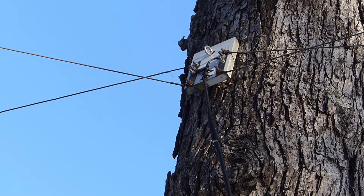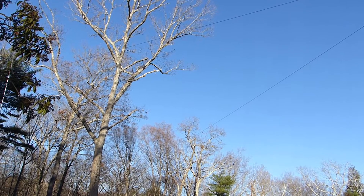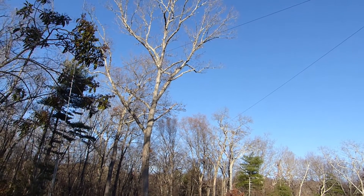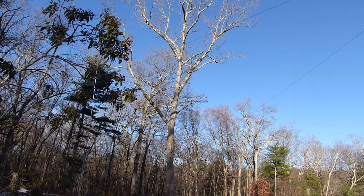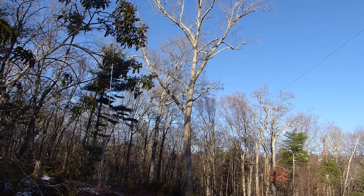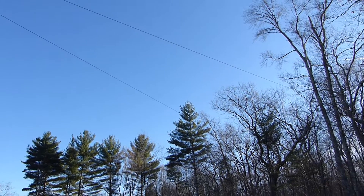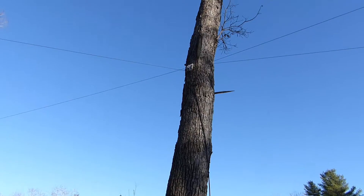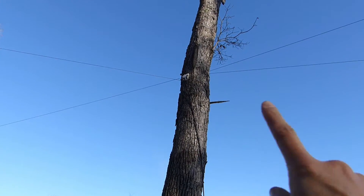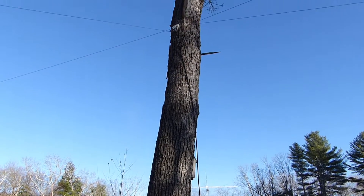The dipole is configured with two legs going out on each side. One leg is cut in length for 80 meters — it's about 60 feet or so — and the other leg is cut for 40 meters, which is around 30 feet. They go off in the trees in one direction and the other way in the opposite direction. The orientation of this antenna is such that the broad side of the wires is roughly east-west — that's looking east, and directly behind me is west.